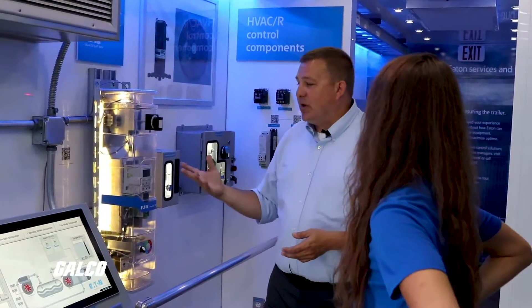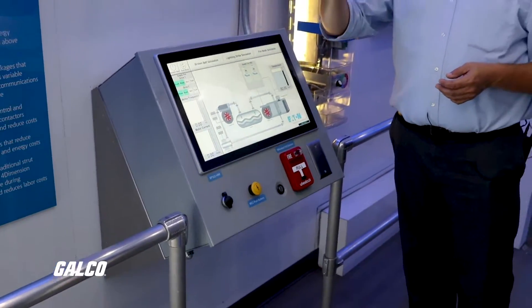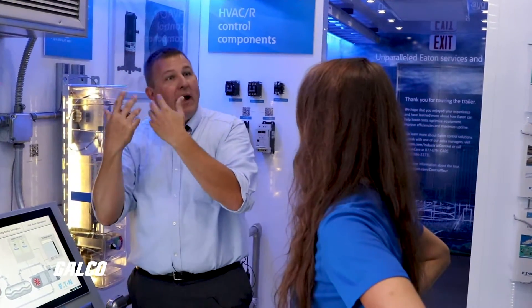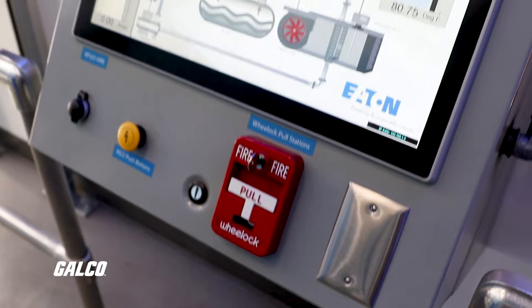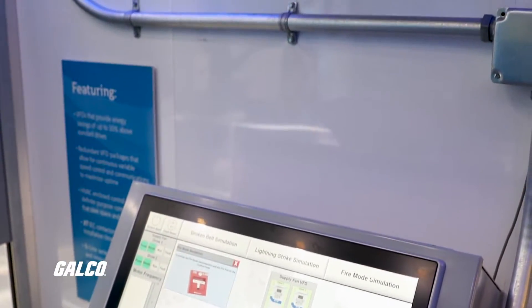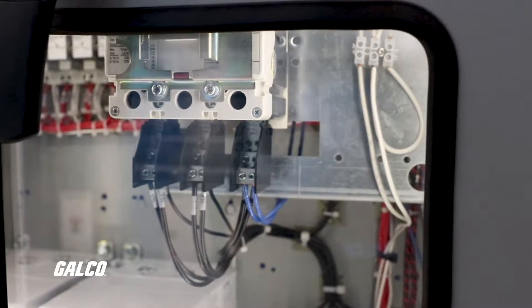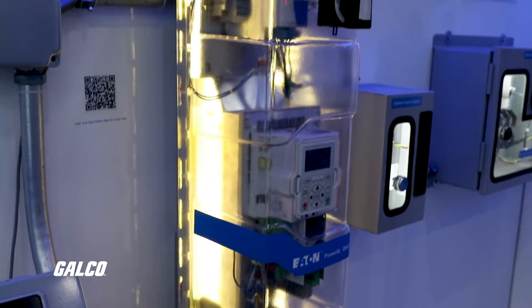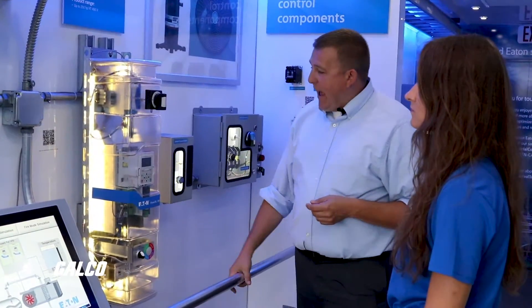One of the things HVAC requires is what's called fire mode. If I have an HVAC system and my VFD is running, it's turning my fan and blowing cool or hot air into the building. If somebody pulls a fire alarm, blowing air into the building heats the fire. When the fire alarm is pulled, the drive knows it's in fire mode — it goes into reverse, starts sucking air out of the building, and shuts down all motor protection parameters. It just runs until it basically burns up to remain safe in a fire application. We have different packages of drives for the DG-1 — this is called our Intellipass option — a packaged unit very typical of what you'd find on a rooftop air handling unit.